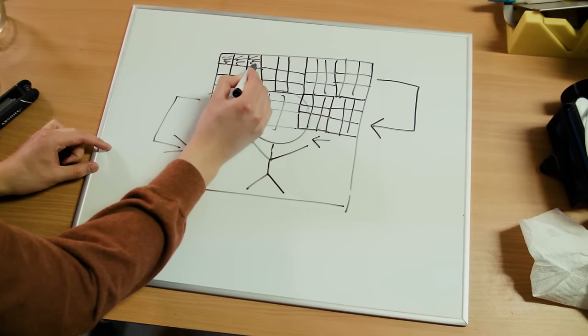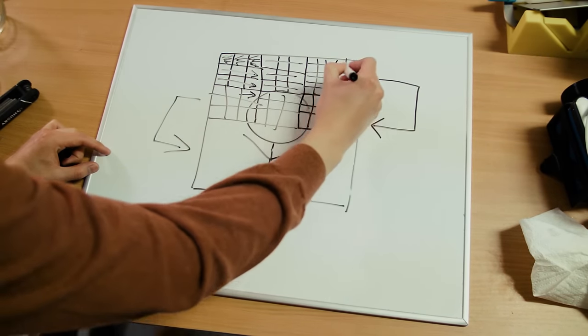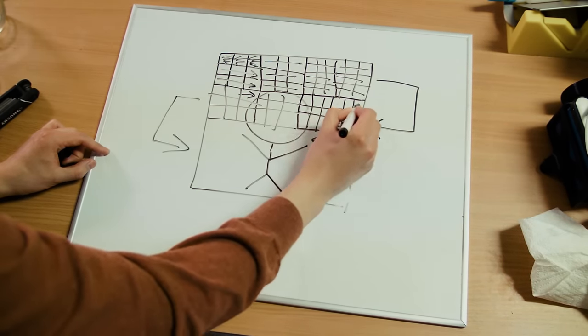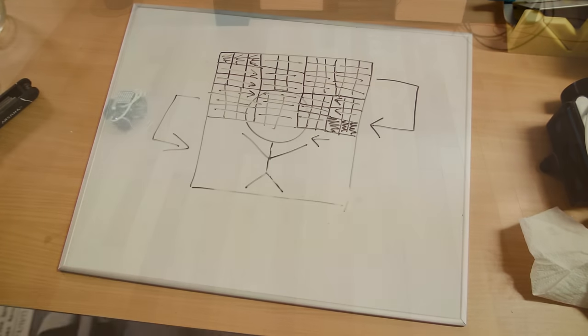RGB values and brightness values are filled in from top to bottom and left to right for the first row, but then after it turns around into the second row, the top now becomes the bottom, gets filled first, and it gets filled in from right to left. This whole pattern gets repeated until the image is done.